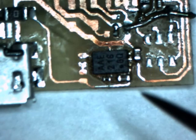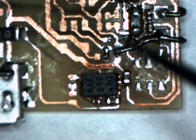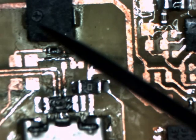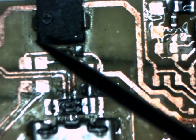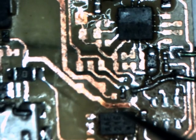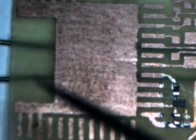The only downside to using the LTC4071 here is that it has a current limit of 60 milliamps. So I believe this buzzer is going to use more than that. So maybe if I build in some more decoupling capacitance, I'll still be able to pull it off. But yeah, that'll replace the charger and the battery protection IC, so we'll see how that goes. And of course, there's the long-range BLE module, the BLE121LR low energy that goes here.